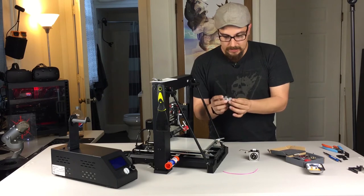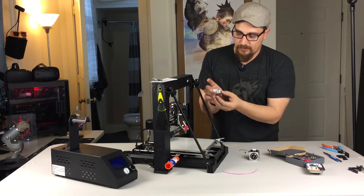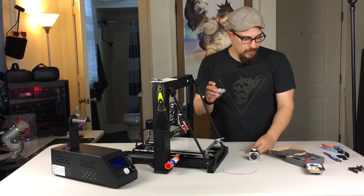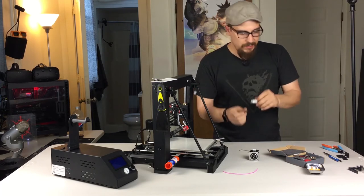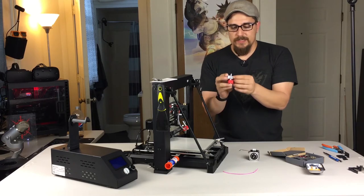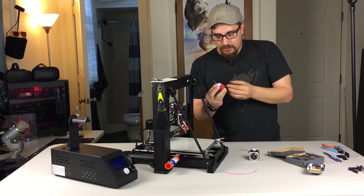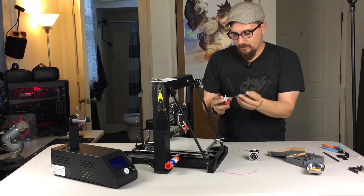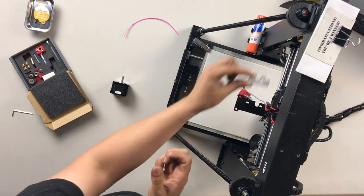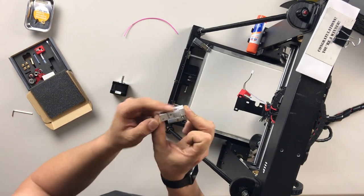Now we have our cooling block and you can see the fins are going to be facing out the left side of the printer. We have holes there for our fan bolts to go through and also two on the bottom. The screws we took off earlier, we're going to be reusing those. But one other thing we're going to need is an actual screw to go right in here — this is going to hold the heat break as it slides up into the cooling block. I didn't see one in the kit, so I just grabbed an extra screw. We basically need a three millimeter screw and make sure it's not too long — so you need to put that screw in there before you continue any further.